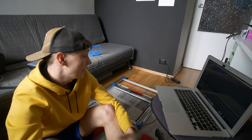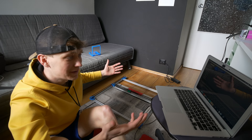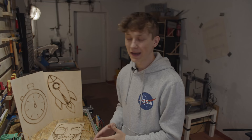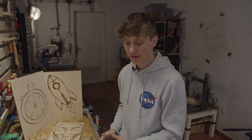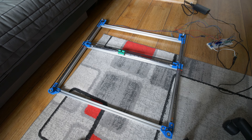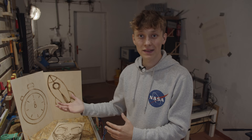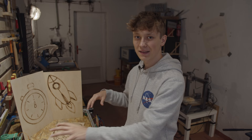So the first design was actually really weak — if not even terrible — so I definitely had to redesign pretty much everything in this plotter. I'm already a few weeks into working on this project but working on it part-time because of university. After the third redesign it's finally close to working fine. An obvious choice to make this machine stiffer is to use linear rails. I used linear rails on the IndyMil and it works great, so I bought 500mm long linear rails — three of them — and this really did improve the stiffness. I kept working on 3D printed parts, redesigning the whole design, and at the same time I started working on the PCB.